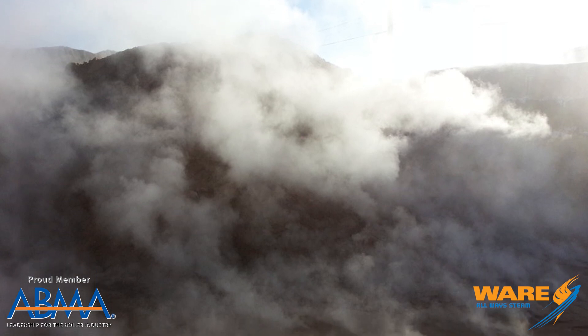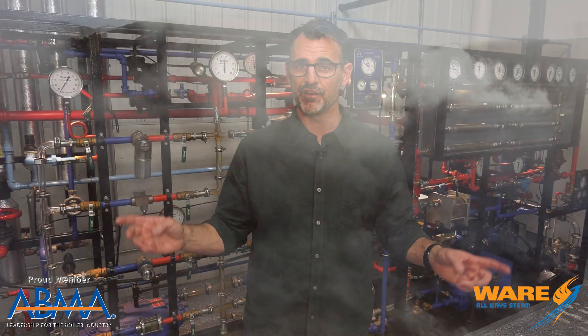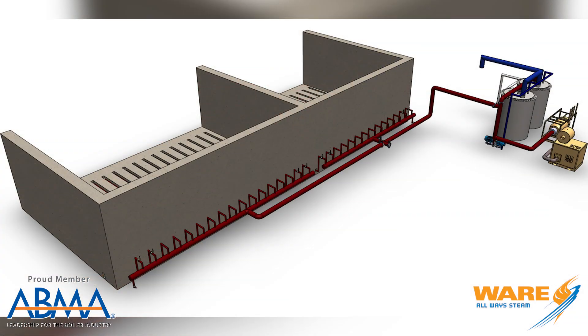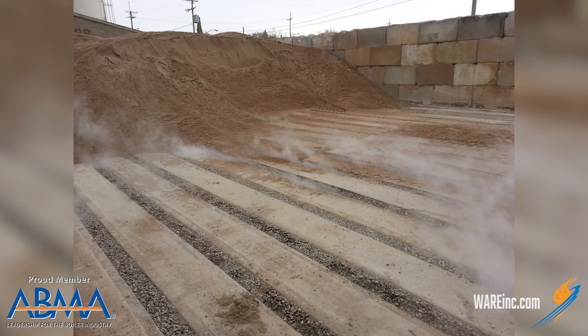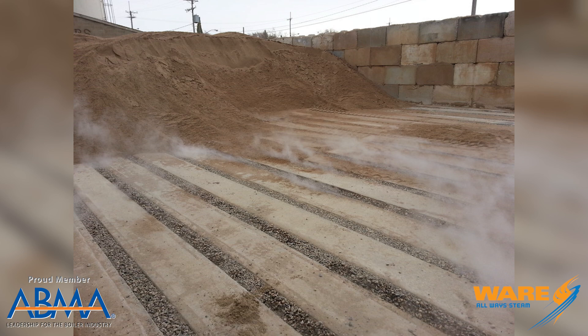to heat the aggregate. One million BTU of low-pressure steam will heat 40 tons of sand to 125 degrees in about an hour. One of the preferred systems is bin heating or grate heating. They'll have a low-pressure steam generator and send steam into a manifold-looking system that goes underneath the aggregate, and they will literally steam that aggregate, or sand, up so that they can make that concrete mix.